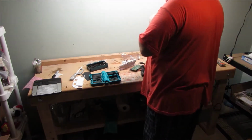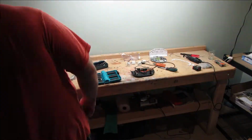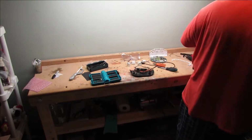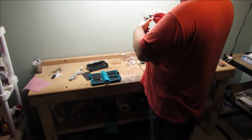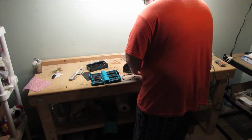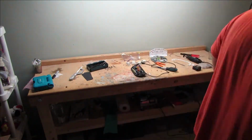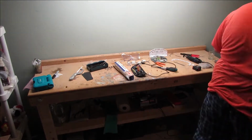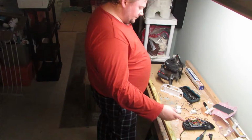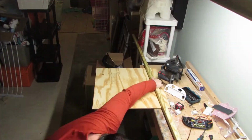I've got. Now, my thought process for this whole thing, and just because of me taking things apart, unscrewing things here and whatnot, was that if I took, instead of just 2 lamps, I took 4 lamps and held them a reasonable distance from anything, that it might work out better. More points of light, more chances to cure the UV curing photoresist. So there I am. Now I'm taking some measurements.